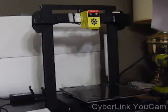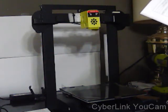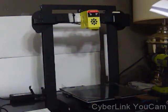Gives you the FOKOOS official website. Points for attention when using the machine. Please make sure that the ambient temperature is between 5 and 38 degrees Celsius and humidity is 20% to 80% RH. Otherwise, the machine may not print normally. Machine cannot be placed in an uneven, humid, dusty environment because it will affect the service life of the machine, resulting in rust, fan rotation, and other phenomena. Yeah, that's what it says. Okay. Do not touch the moving parts with your hands to avoid being pinched. Basic, you know, for adults, basic common knowledge. Now, if this was a kid, you know, of course you want to go over it with your kids or whatever. Gives you the parameters of the machine.